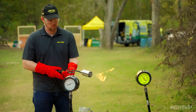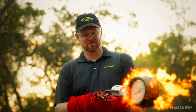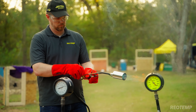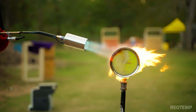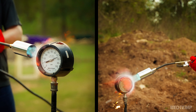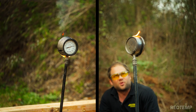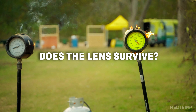In our first test we are burning three models of gauges: a phenolic case with tempered safety glass lens, a phenolic case with laminated safety glass lens, and a stainless steel case with plastic lens. We want to test three things. First, is the case combustible? Neither case is fueling the fire — the stainless steel case gets red-hot and the phenolic case cracks and crumbles, but the only things that burn are the rubber seals.